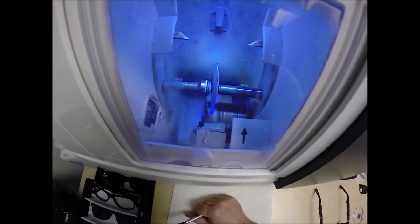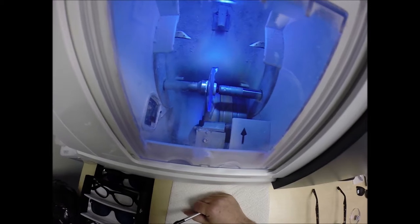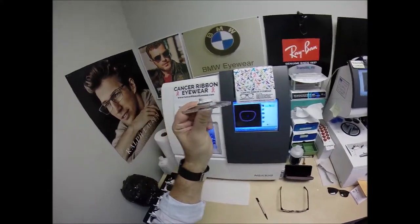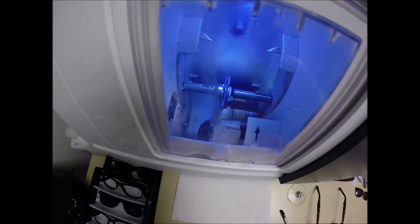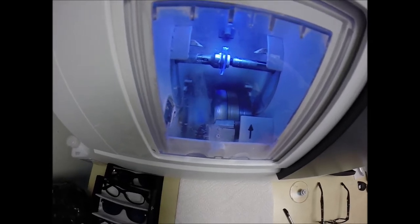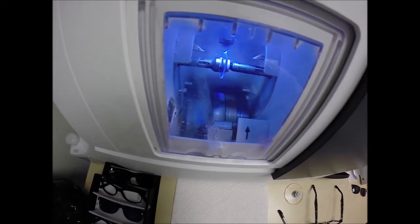Polycarbonate lenses cut dry, meaning no water sprays onto the lens while it is cutting — unlike plastic, high-index plastic, and Trivex, which all cut wet. Water will spray on Sharon's lenses only for the last 20 seconds to wash away the optical debris. Her lenses are polycarbonate, which is 40% thinner and lighter than regular plastic, virtually unbreakable — ballistics-grade lens material, the same material our soldiers wear in combat zones. It has 100% UVA and UVB protection built in, and your eyes are eight times more sensitive to UV than your skin, so this is permanent sunscreen for your eyes.